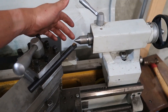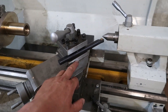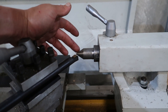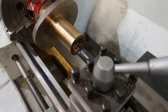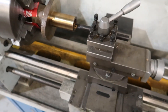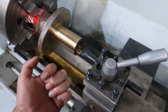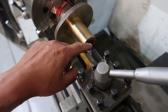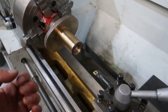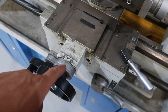To set up the boring bar, you have to have it just below the center point of the lathe. I'm going to measure the distance between the tip there and there, then put in shims and lift it back up. With the shims in, the tip of the boring bar is just below the tip of the tailstock. I'm going to push this in until it touches and set this to zero, so when I go in to bore, I know that when I stop at zero that's reached the bottom of that part. I've done the same thing for this direction and set that to zero, so now I know how much I need to go out to reach my distance. That's currently 30mm in diameter, so I need to open that up to 31.25 - we need to move this out 1.25mm.